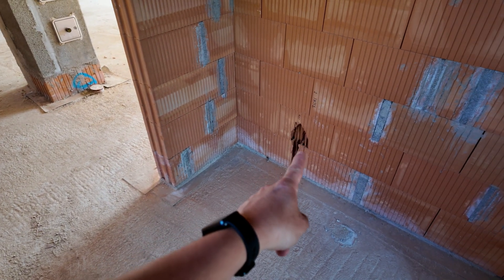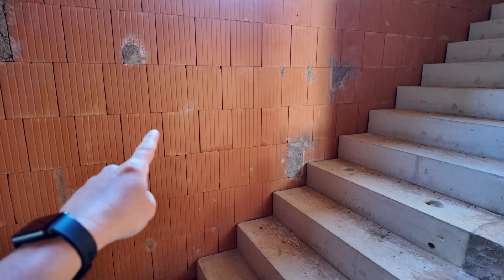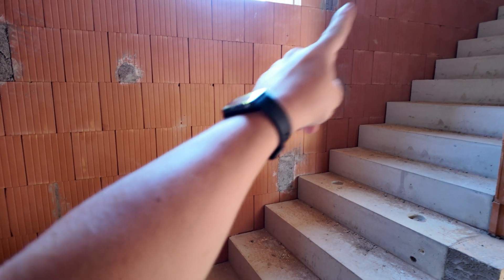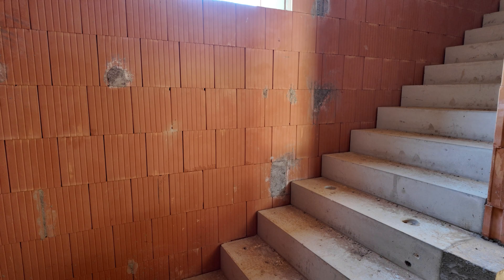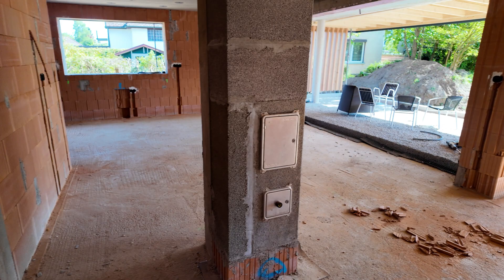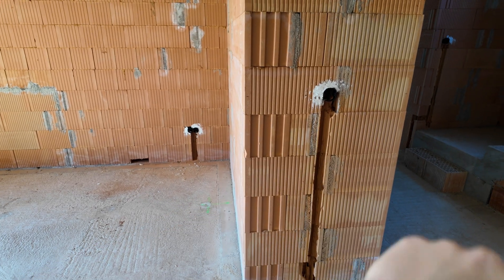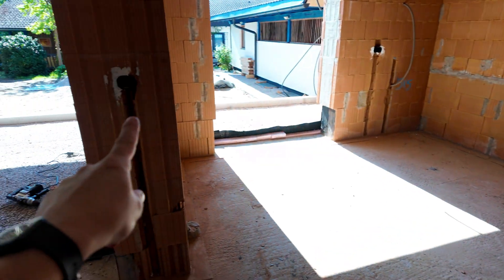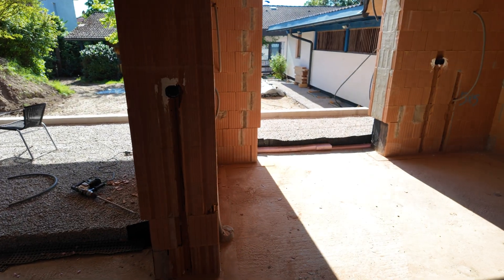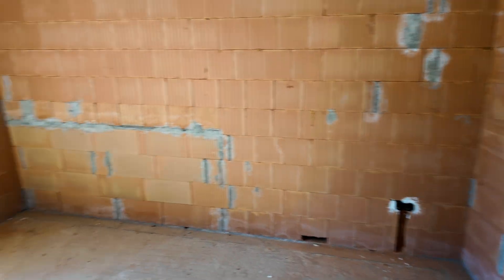There are a lot of special requirements here. There will be an LED strip RGBW in the wardrobe. At the stairs, where you hold the handrail, there will be an LED strip as well. We have another push button here, presence sensors in every room, and a super nice open-space living, dining, kitchen area. We have a push button to leave the whole area and a dedicated one for the living room. There will also be a wall for the TV with RGBW LED strips.